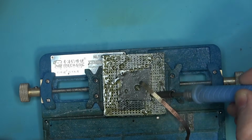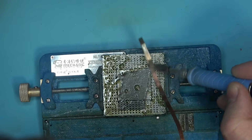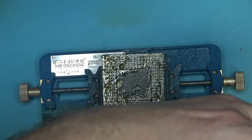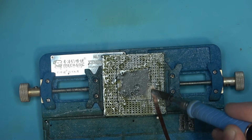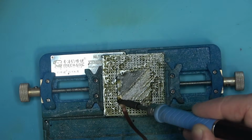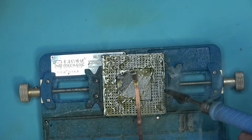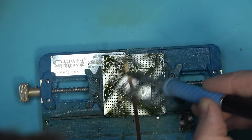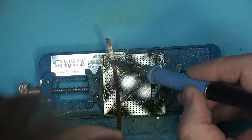My only hope is that it's going to work for a reball as well. Though it could present problems because of its early low boiling point, but that's just the initial phase. As it heats up, it breaks down, there are at least two different elements, and when that happens, can you really guarantee that I will have a usable chemical composition across the entire chip as I am soldering it down?